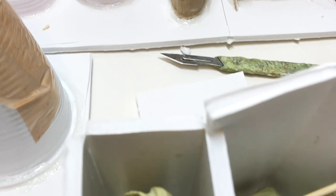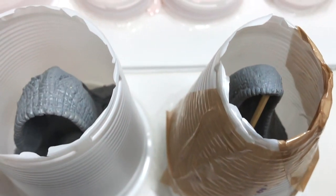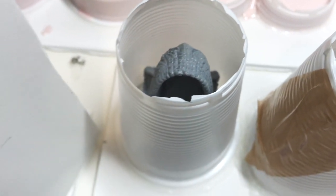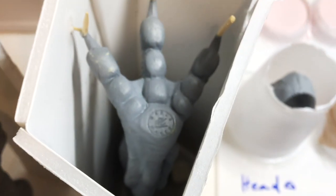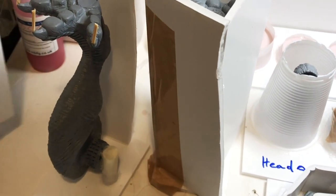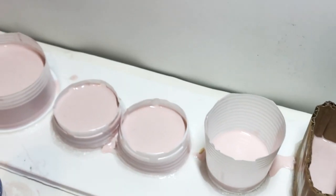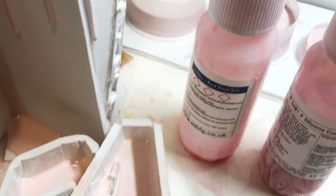I made some walls around the parts that need moulding with foam board and the plastic cups again. I have prepared the arms, the head and the jaw, and the legs. On the legs, I have added a straw which will actually act as a pour hole — that is where we're going to pour the casting material into the mould. Once everything is completely sealed, I repeated the same process and poured the silicone rubber mixed with the catalyst.